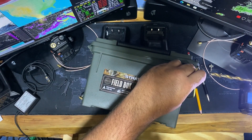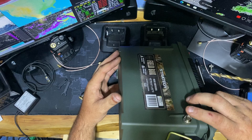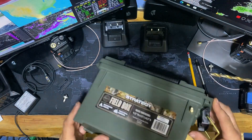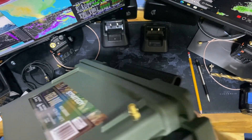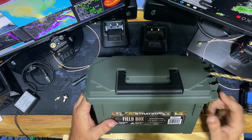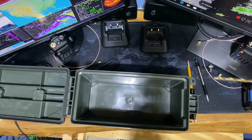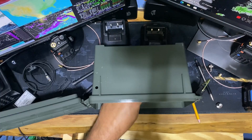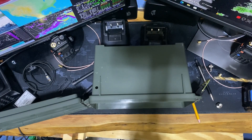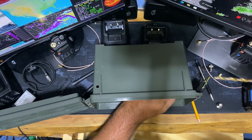Let's do a test fit. The smooth part of the connector slides through the hole, but the hex does not — just like that. I've got one in this corner; I'm going to put another one in the opposite corner. This is where the wrenches from Joe Brett, K5YVY, come in handy. It doesn't have to be a perfect fit, but it has to slide through. Just do a little trimming on the burnt edges from the drill bit.